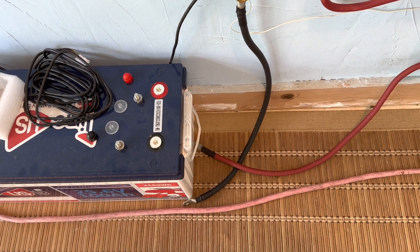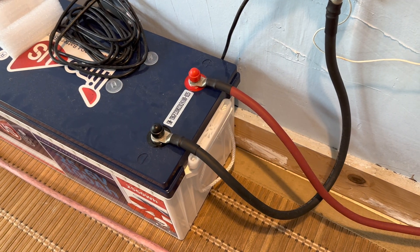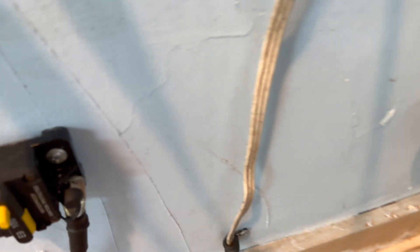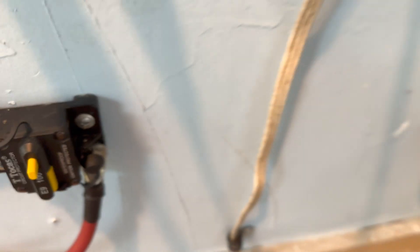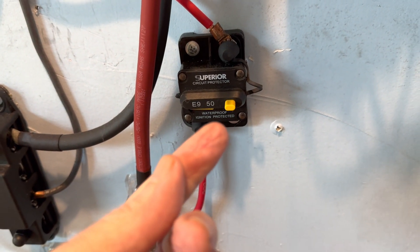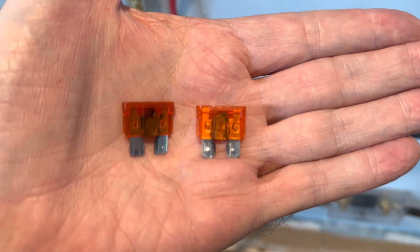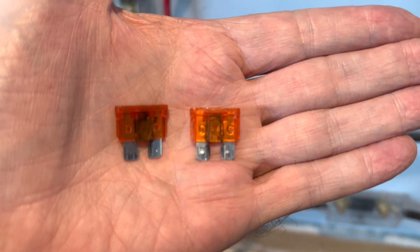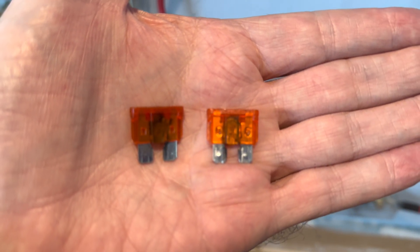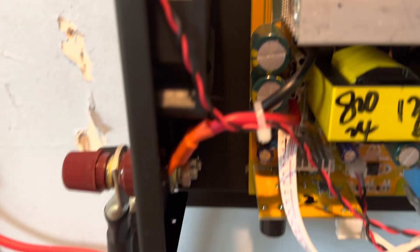Okay, now I'm going to reconnect the battery cables and start flipping this back into action. Well — that quickly escalated. After hooking the cables back up, the first thing I did was flip the breaker back on to get battery power back to the inverter, and before I could even get to the solar panels, the replacement fuse blew immediately as soon as battery power came back. It made a very loud pop that made me jump. The new fuse on the left is even more fried than the original was.